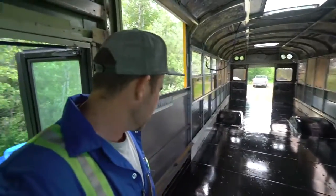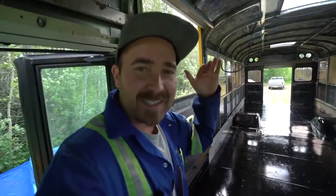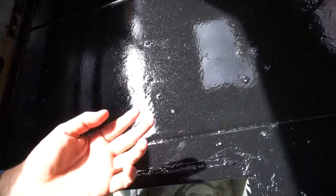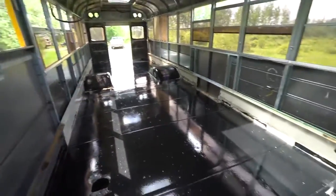Note to self: if you're doing oil-based paint and it's not consistently above 70 degrees, and if it is a moist day, this stuff is going to take forever to dry. Look at that — it's still tacky, not wet, but just sticky. So this thing is going to take all day to dry.